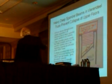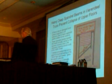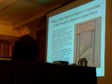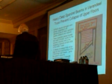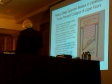Now those are being carried from this set of columns over to this set of columns. And I got to read this to you. You're not going to believe this. This is a quote: "A design procedure that will be used for structural framing of the 1,350-foot high twin towers." This was written before it was built. It's actually 1,368 feet, and the 2 towers are slightly different in height, but just about that. "This gives the exterior columns tremendous reserve strength. Live loads can be increased more than 2,000% before failure occurs." This was written in Engineering News Record, July 8, 1965.